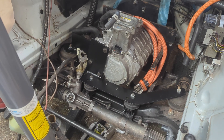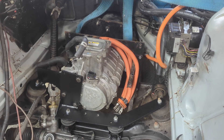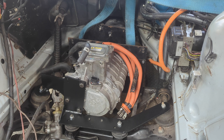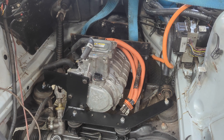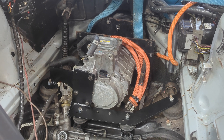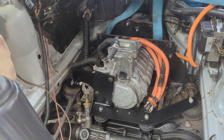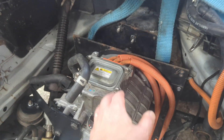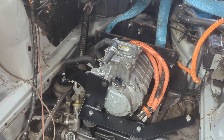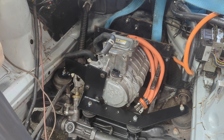It is installed and all torqued down. I've finished up underneath — torquing up all the gearbox mounting bolts and everything else. I just need to torque up the locking collar on the prop shaft — just remember that, I need to go and do that — and I need to torque these nuts and bolts up here as well. But that is just such a dramatic improvement. That, as they say, is going nowhere. Power delivery is going to be fun — I'll have a lot more confidence boosting it now.